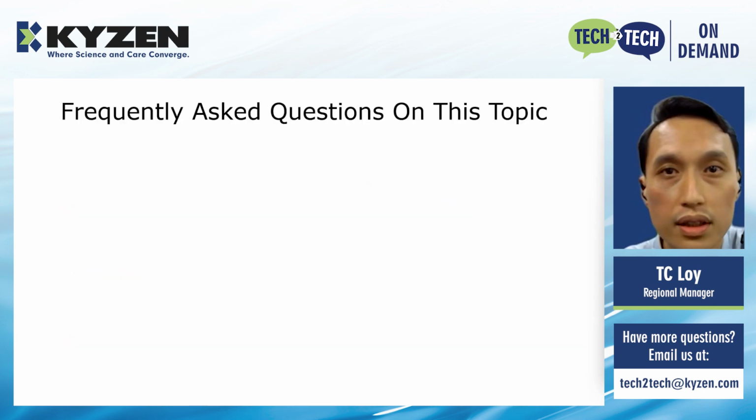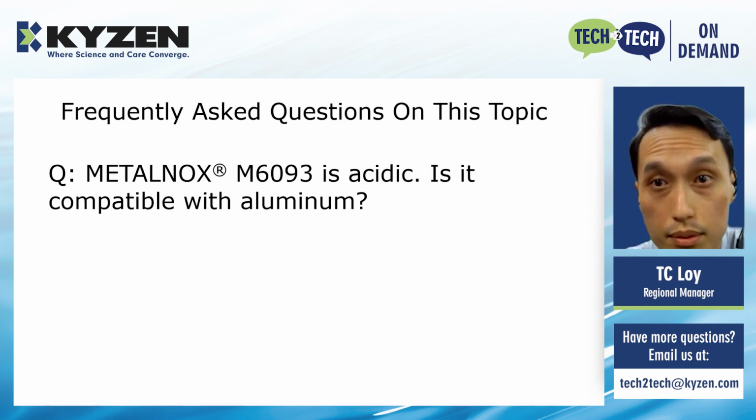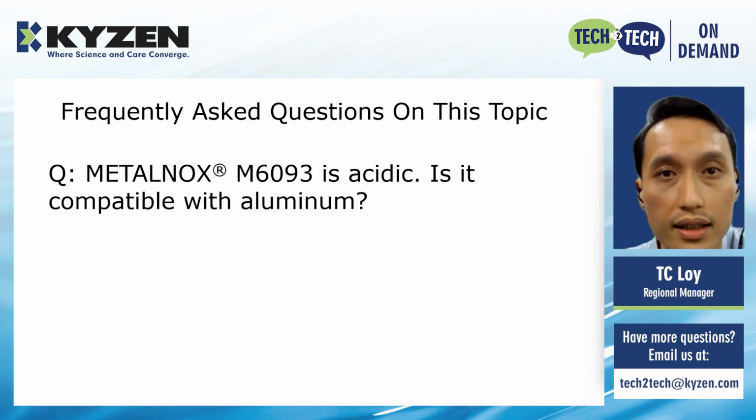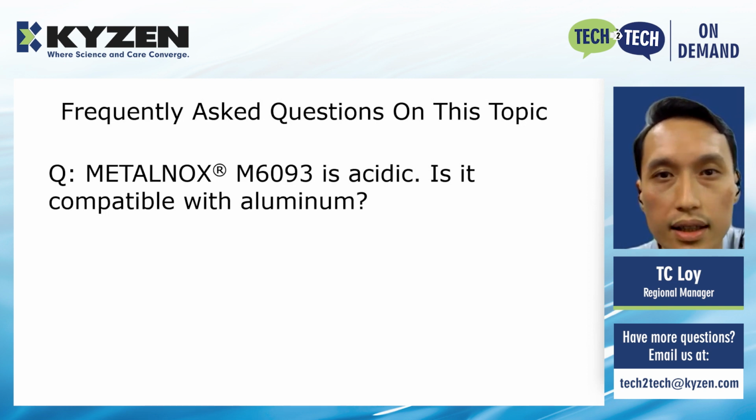Let's go through some frequently asked questions on this topic. METALNOX M6093 is acidic. Is it compatible with aluminum? METALNOX M6093 is a mild acid. It is compatible with aluminum. It will not corrode aluminum even after soaking for hours. On the other hand, aluminum is not compatible with strong alkaline. Choosing a compatible alkaline cleaning chemical is crucial for aluminum parts.